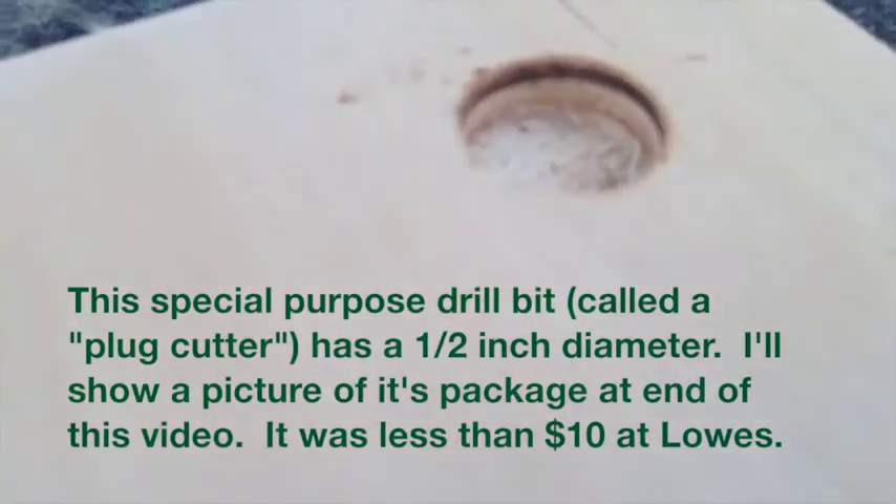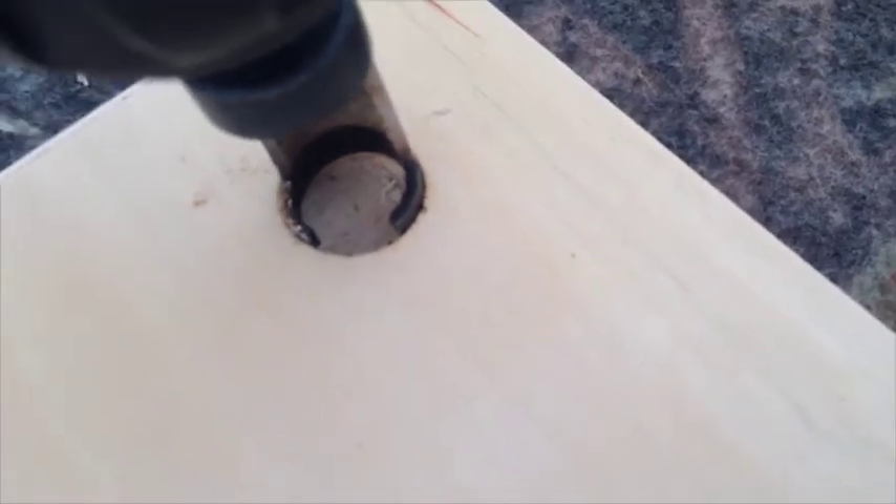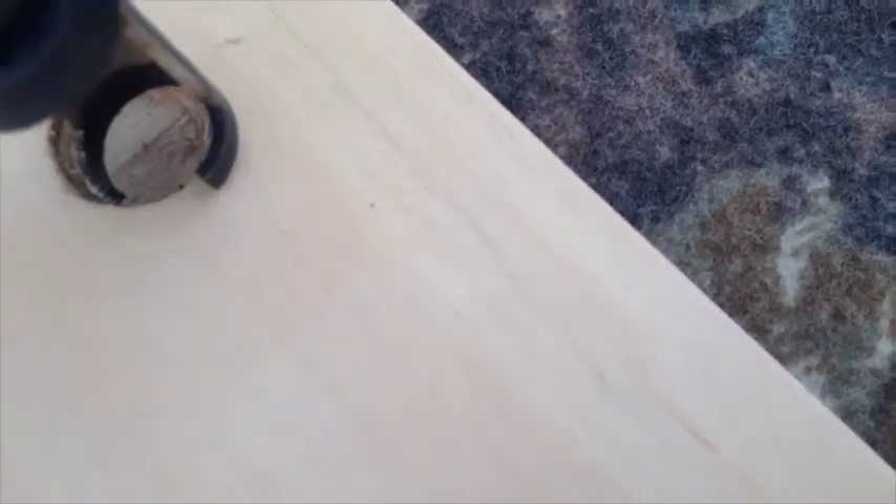One thing to note is that when you start the hole, the bit is going to want to walk. If you're spinning the drill fast and you really have a good hold on it — almost like a body hold, not just your arm stuck way out in front — get your body up close so you can stabilize and then go down on the hole. The faster the bit is spinning, the quicker you're going to lose that walk. However, if you get a little on an edge, the power can really send the bit off to the side pretty quick. If you're trying to spin the bit too slow, it's going to walk on you and mar things up. It's not that bad if you mar this up because it's going to be underneath the leg anyway.